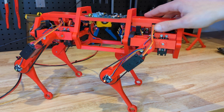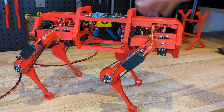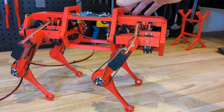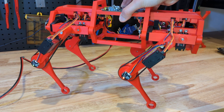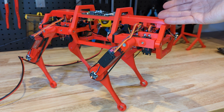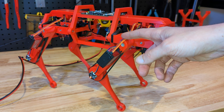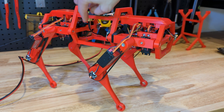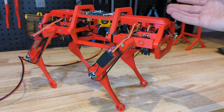Now for the kinematics of the whole robot. We look at the center of the body and combine the inverse kinematics of the legs to make the body move along three axes. It's pretty straightforward: when we want to move the body along the x-axis in the positive direction, we move all the feet the same distance in the negative direction, and the same is true for the other two axes. One thing I had to learn the hard way is that you want to have consistent coordinate systems between the various kinematic models — the body and the legs should share the same axes. For example, I started with the legs using a z-axis going from the origin of the leg down to the ground, and a z-axis from the body going from the body center up to the ceiling — and other fun things which made it really hard to combine the kinematic models correctly. So be consistent with the axes.